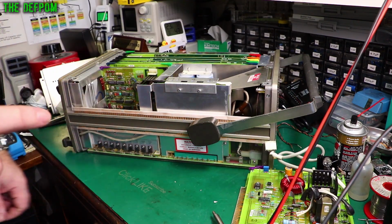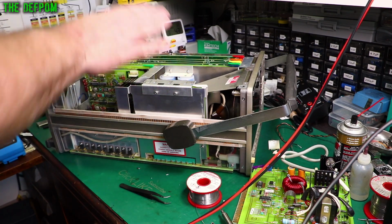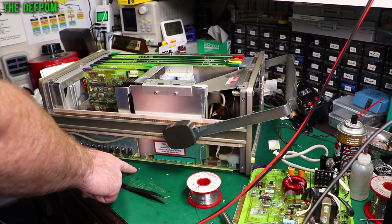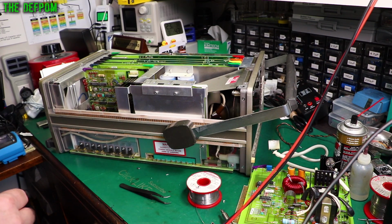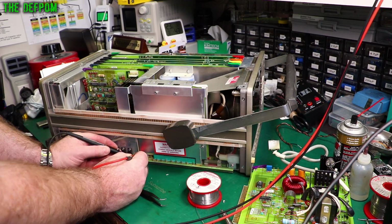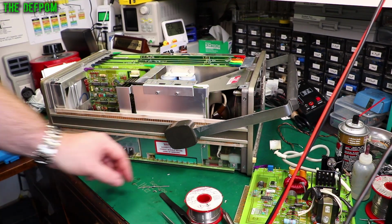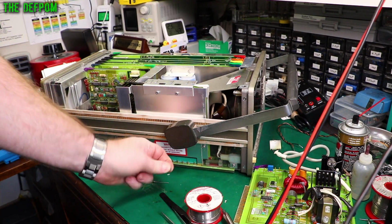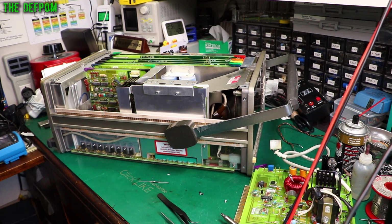Let's lift the diode first, we'll try that. So I just lifted the diode up, after eliminating all the cards as a problem. Lifting it out, and it broke in half. Now either that's bad luck, and I put too much stress on it and it snapped, or it was actually blown. Let's remeasure it, and we're still getting 21 ohms. It wasn't the diode. So that diode comes back to being a 1N4004. Common diode, not unusual at all. I've got a bunch of them.